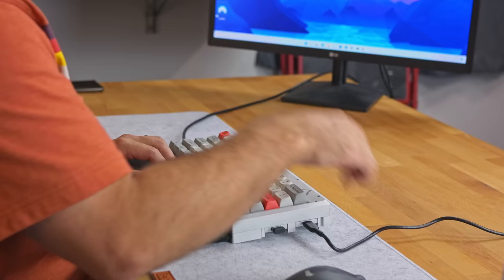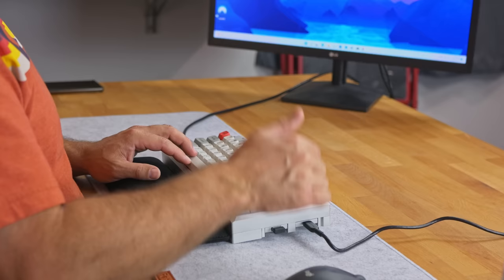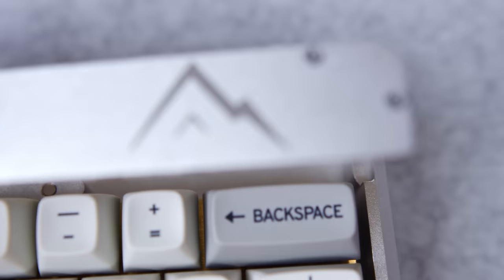Not sure why that is, but there are still bugs when using the mainboard outside of the laptop case or disconnected from the battery. One of those being that once you boot the PC the first time and then shut it down, you need to disconnect and reconnect it to the power to restart it, or sometimes you can press and hold the surface mounted power button for several seconds to reset it. But I found that just setting the BIOS to boot on power connect seems to work every time.